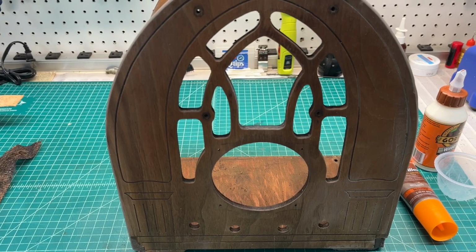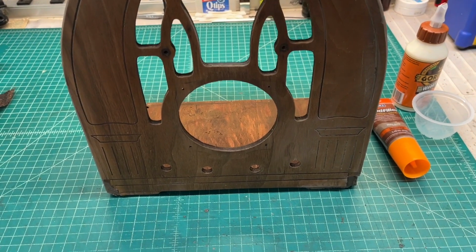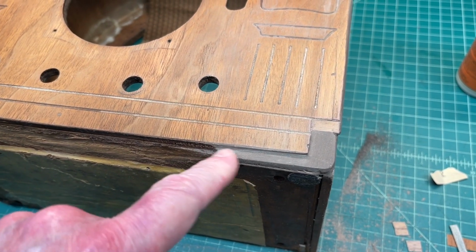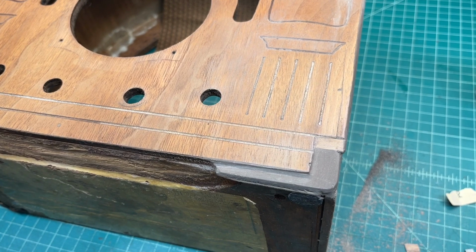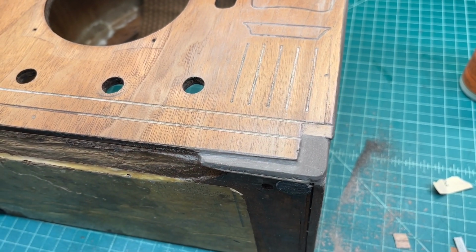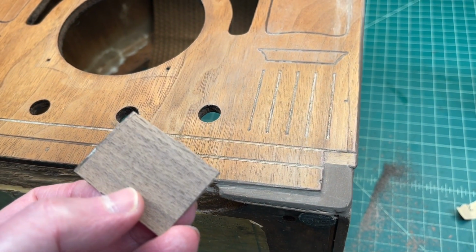doing some light sanding and some more fill-in work, and then I'll move over here to some of the veneer patch-up work as well. Look at the area that I filled in with the wood filler in this right corner. Still got to do some sanding over here on the left side to get the substrate flat, but I think this is a good base now. I took about 4 pieces of veneer, some thin veneer that I had, and I've glued it together.